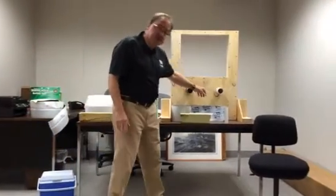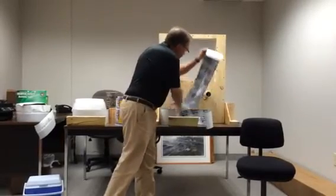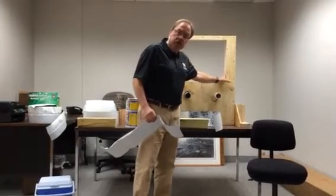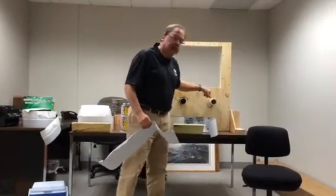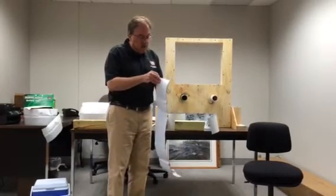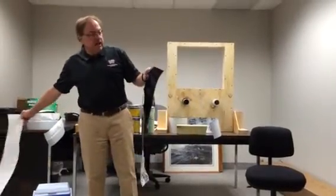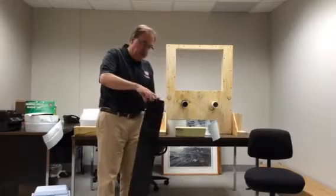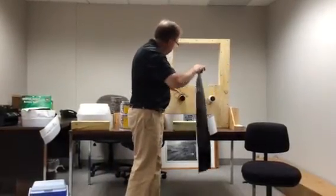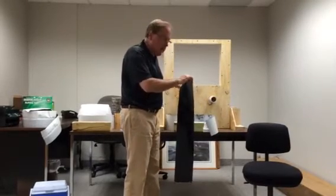The next product is a sill pan flashing. A big challenge we all have in the construction industry, especially in the Midwest, is when you put in windows and doors, is moisture and water finding its way through the bottom corners of the opening. There's been rigid weather stripping, there's been tapes. People have used the Tyvek flex tape. This is a product manufactured by Protecto wrap that when I measure the opening, I want to come up approximately 6 inches up on each side.